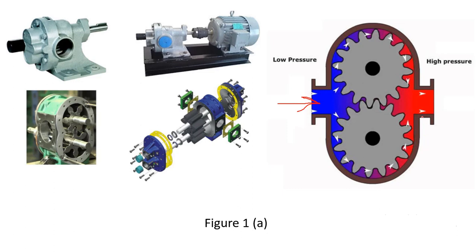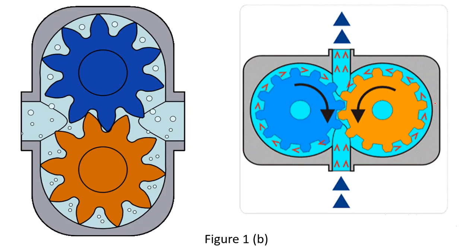The pressure in this kind of pump can be raised as high as 200 atmospheric pressure — one atmospheric pressure equals 76 centimeters of mercury column. This pump is used to increase pressure significantly, though it doesn't work for very high throughput. It is used primarily for creating very high pressure.